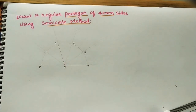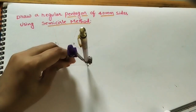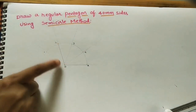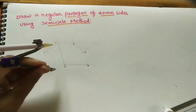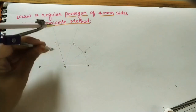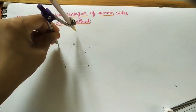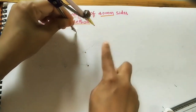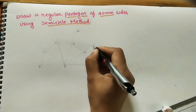After dividing the semicircle into five equal divisions, we build the pentagon. The pentagon side is 4 centimeters. The initial base line OE is one side of the polygon, and O2 is the adjacent side. Since all sides of a regular polygon are equal at 4 centimeters, from point 2 draw an arc onto the inclined line, and similarly from the other point draw an arc onto that inclined line. Mark these intersection points — this is point B and this is point C.